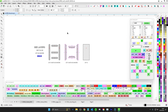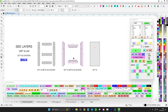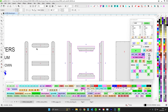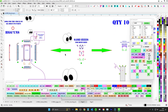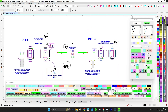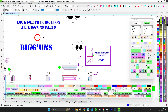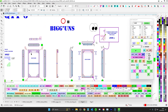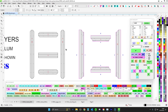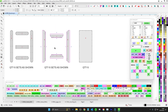I broke it down into the bigs and the smalls. They're basically the same parts — same principle, same construction — except the overall dimensions are different. The width and how it goes together is all the same. For the bigs, make sure you're looking for a circle. In a high production run, reference marks add up time. I took the lesser of the two, gave it a scribe, and instead of a stencil for the big ones I just did a circle, so look for circles on all the frame parts for the biggins.